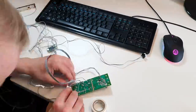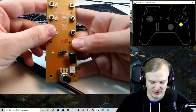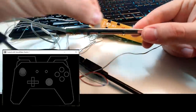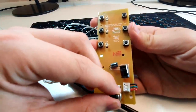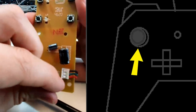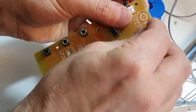I insulated most of the contacts to make sure they don't touch anything they shouldn't, then coded the remaining gamepad inputs using the new testing tool. When I press a button, the correct input on the gamepad lights up — working pretty well. Unfortunately, the rotary potentiometer from the toaster didn't seem to work with the Teensy; it would jump erratically when rotated past the middle. So I had to spend my last joker on figuring out a solution, which ended up being simply using a different potentiometer instead.